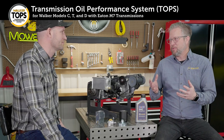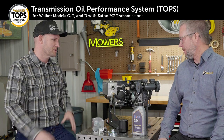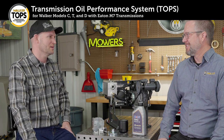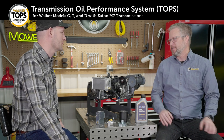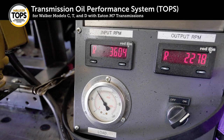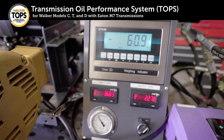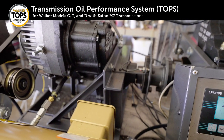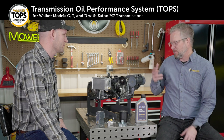So you're kind of testing worst-case scenario but with real operation, because you're constantly moving forward and backward. We wanted to incorporate that reversal occasionally, but we feel like it's pretty worst case — I don't think anybody drives their machine up a hill forever. And what are you monitoring with the system? The test stand monitors the input and output RPM of the transmission, the output load of the transmission, and we set it to a certain torque output. Along with that, we're monitoring the oil temperature in the transmissions as well as ambient temperature so we can find out what that delta is. All that information has led into what we've developed here with the new pump, reservoir, and TOPS system.